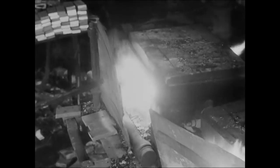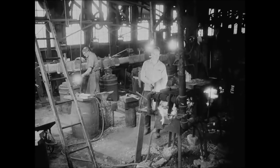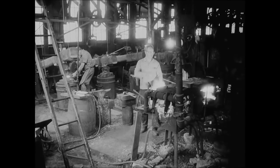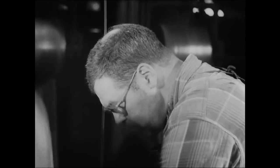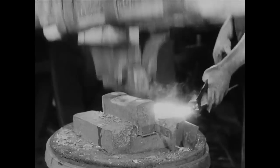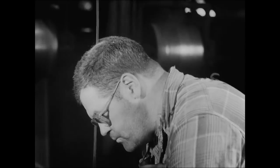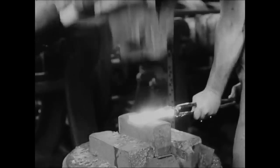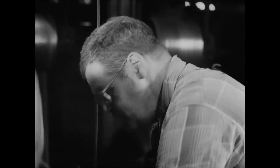In an oil-fired furnace, each bar or pattern reaches intense red heat, and the first step in forming the pole or head of the axe is begun. The ends of the pattern are plated or flattened under the uncompromising steel faces of the trip hammer. The pounding head is strapped by heavy steel bands to a huge beam of solid rock maple, which rises and falls by cam action.